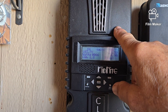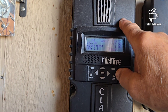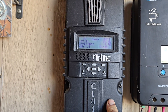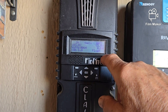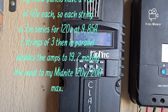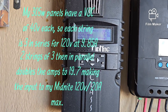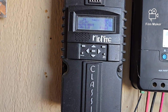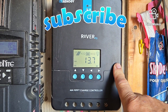The numbers mean the amount of voltage total that you can put into your controller, but they also factor in the voltage of your battery bank. This is a Midnight Classic 150 — that's 150 volts allowed plus the voltage of my battery bank which is 12 volts, so I could put 162 volts into this unit and it'll still be safe. If you had a 250, that would allow you to put 250 volts in. Remember: when you hook solar panels in series, the voltages add up but the amps stay the same — so you can use smaller wire. When you hook them in parallel, your amps add up and your voltage stays the same. Same with batteries.